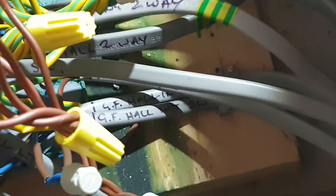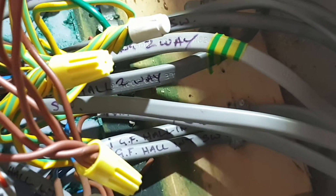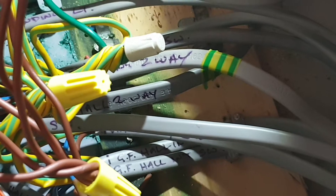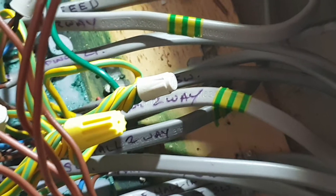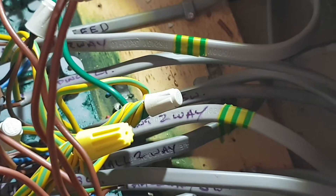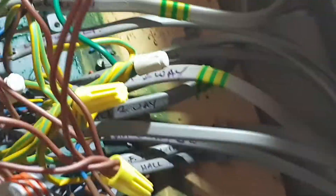Another way to fix it — and this involves a lot of work — is to renew your wiring. If you've got old cabling, that could be your problem. Some people have actually replaced their cables with Cat5 or Cat6 cabling, as you get less voltage drop. It's all about the voltage drop you're getting because there's only three volts running through your little lighting switch circuit. Changing the cables may help, but may also not — so it could be a load of work for nothing.